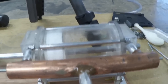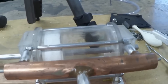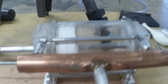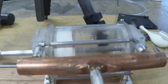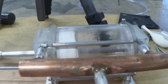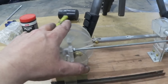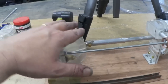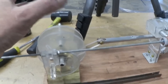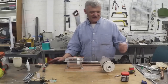If we change the timing — remember we had it 90 degrees in a clockwise rotation — the engine will reverse. What we're still missing is the flywheel. We have the whole crank set up but we're missing the flywheel to take it past that final position. We do need that inertia to carry it so that the reciprocation continues.